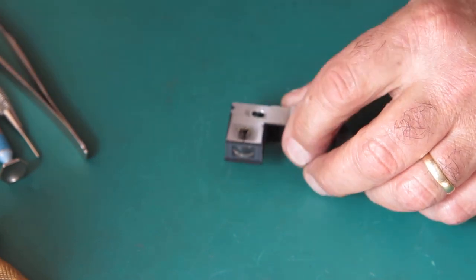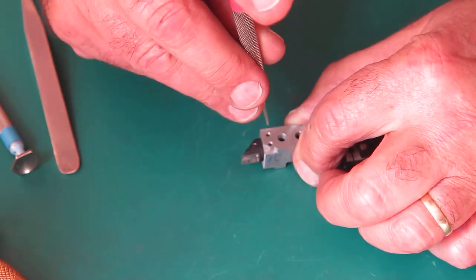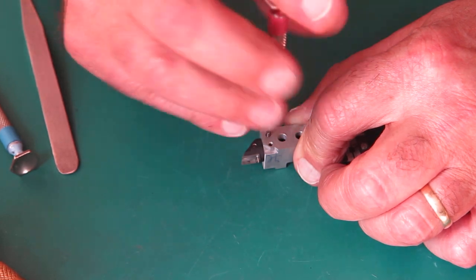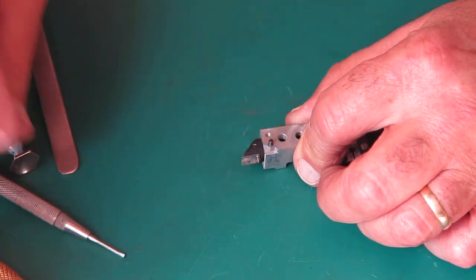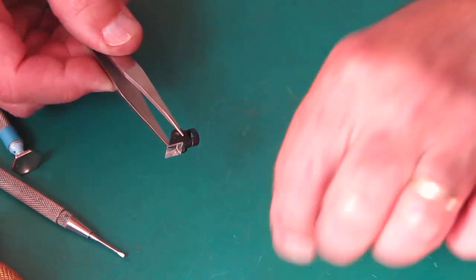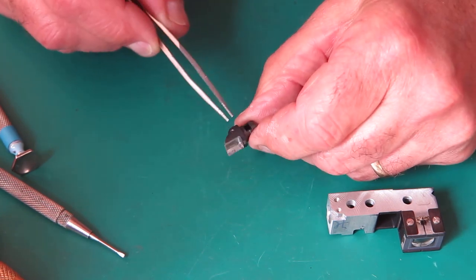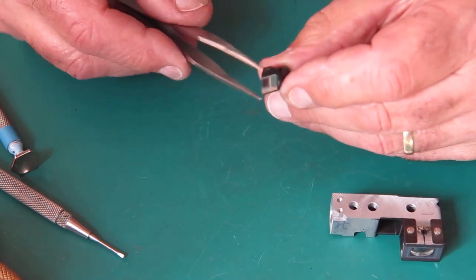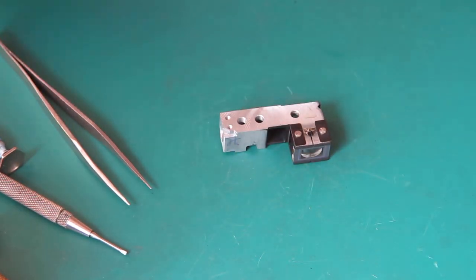If it's fitted in that slot there it doesn't run anywhere. The prism on the end — two small screws hold that in place and they also serve to adjust the position of the prism for the vertical alignment of the rangefinder images. The glass prism is held into this bracket with a little screw and some lacquer. Don't disturb the screw and don't muck with the lacquer — you'll have a hell of a job getting it back in correct alignment.